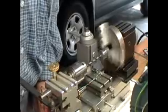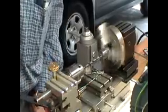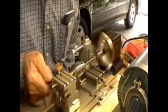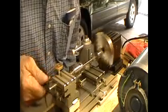You've seen me start the hole — there's no point in you seeing me finish it. I'm switching off here. Now we go down to ream the hole to 0.1865", just a little bit undersized so we can press the shaft.